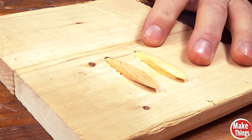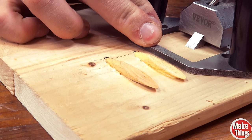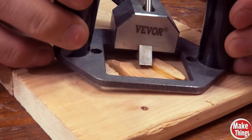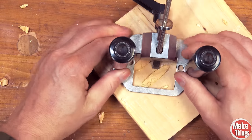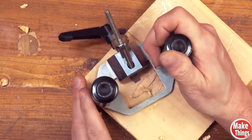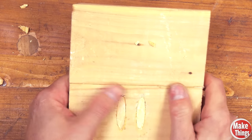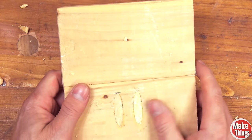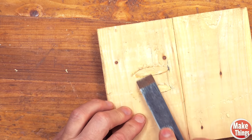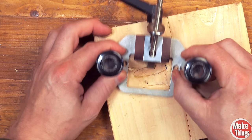If you like using pocket holes, the same thing applies. I'm going to lower this to the surface — I think it pretty much already is. I'll push down and then drop it a little bit. At first glance it looks like this would be very difficult to do, but watch — it's really not that hard at all. It cleans up really nicely and it's very smooth. When I use a chisel, sometimes I feel like I'm cutting into the other wood. With this, it really can't go below the surface; it goes as far down as you set it.